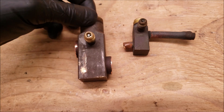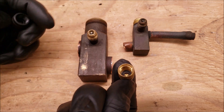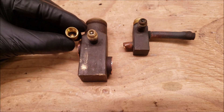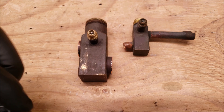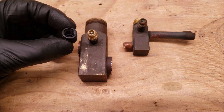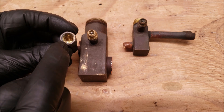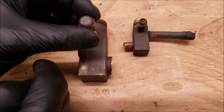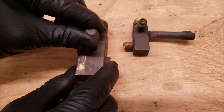You're also front seating this one to lock the refrigerant in the outdoor unit. You have multiple kinds of caps for the ports to lock the refrigerant in in case these valve cores start leaking. This one right here is a brass valve cap and it has an O-ring inside, so that O-ring is going to squish up against the flare seat and hold any refrigerant inside this port. This right here is a plastic one, which is very common — but I typically replace these with a metal one. This one is a flare-type valve cap. You need to drop a dab of refrigerant oil down inside on the flare seat, and that's going to tighten up against this flare seat. There is no rubber in that at all, so you have to give it a good snug with a small adjustable wrench.